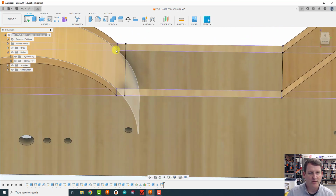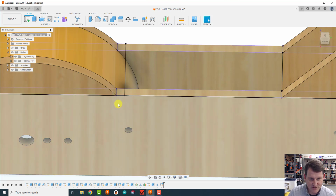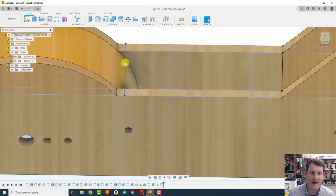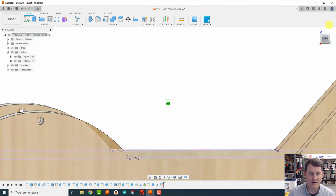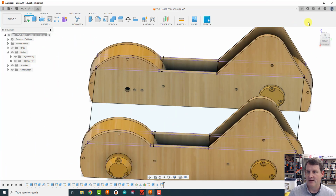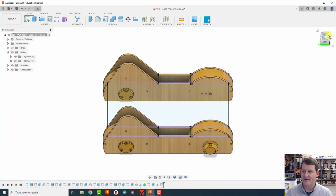If we drew a line straight across this corner, the plastic is still moving out this way because we're going to take our plywood and extrude it down in this direction. It would actually cut and hit into the wheel cover, and then we'd have to cut it off later. So we pulled the plywood back a little bit so as it goes down, it won't ever hit the wheel cover here. Awesome. That's something I learned the hard way by cutting a piece and then it not fitting, and I had to go back and redo it.